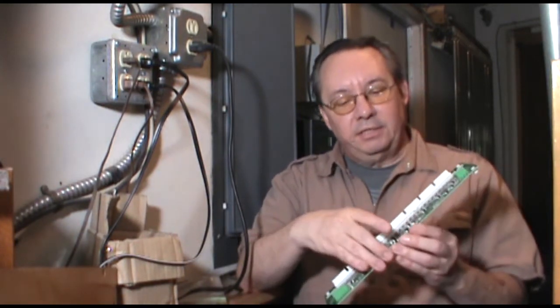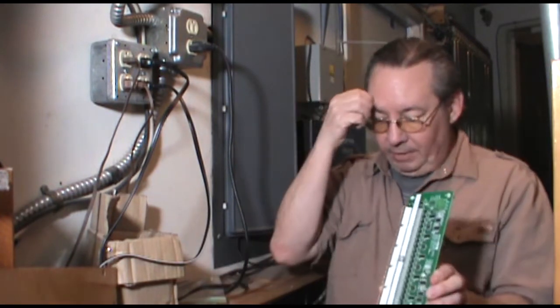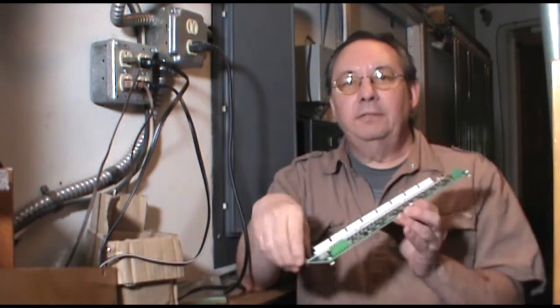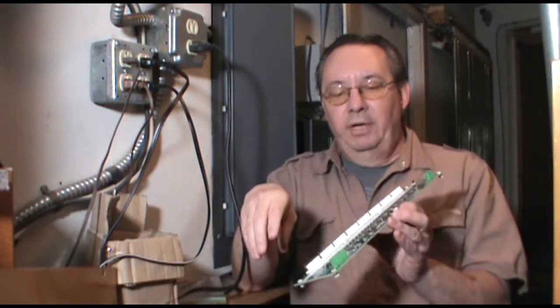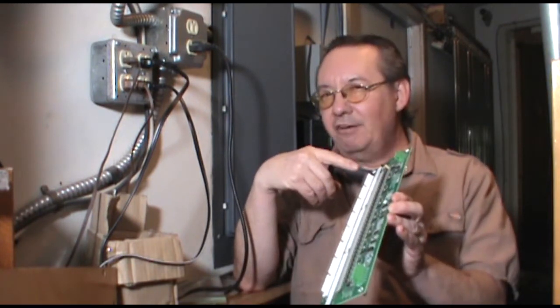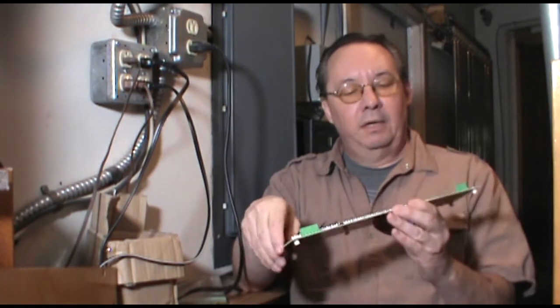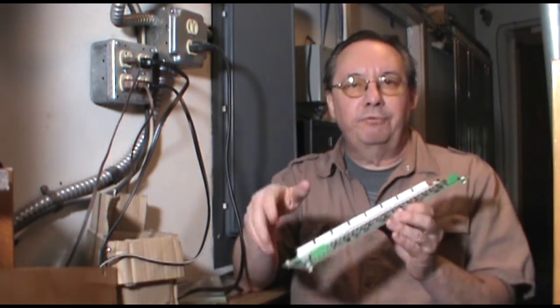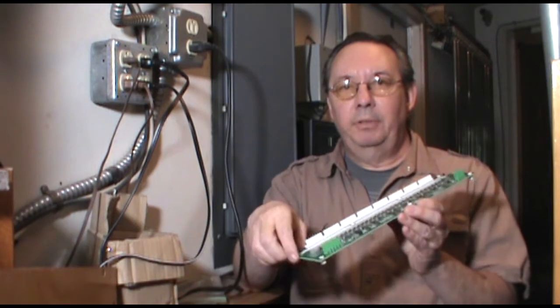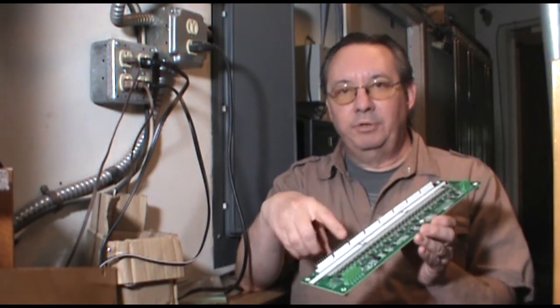In this case, each of these cards has 64 points. We can run them together in a couple of different ways. These cards will run about an amp and a half, maybe a little more per data point, and there's a total load limit per card. In most cases, for dealing with an electro-pneumatic action, we'll just hook up so that every pipe valve is on a separate data pin.